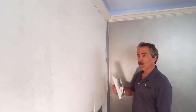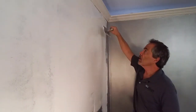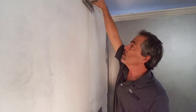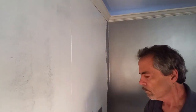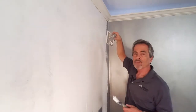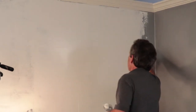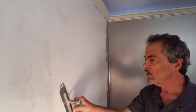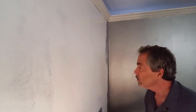This technique is called walking the line — heel and toe. More pressure towards the toe and back off on the heel. Now I see I left a line there — I'm going to walk that to the left and continue all the way down. Take off the excess. Now I'm going to put more pressure towards the heel and back off on the toe. You can see the line is getting smaller and smaller. The material is starting to set up also, so it's getting a little tackier and easier to work. When you first put it on it's pretty loose, but now I'm getting a little bit of friction so it's easier to work.